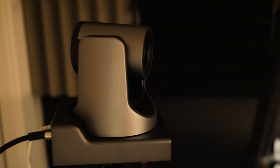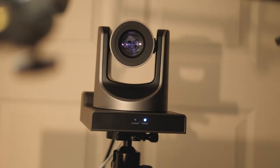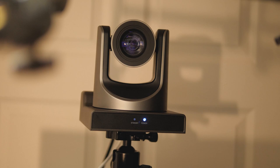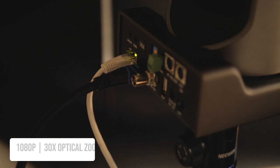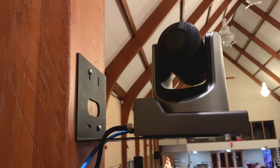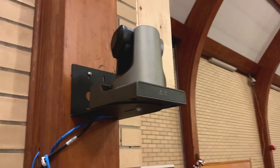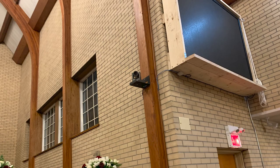The second thing we have is multiple PTZ cameras — to start, we began with two. The PTZ cameras we're using are AVCANZ, and they both have 30 times optical zoom and NDI. We're not going to be using the NDI feature because we have a switcher, so we're connecting directly with an HDMI cable. For longer distances, we run SDI from the camera and then use an HDMI converter to input into the Blackmagic ATEM Mini Xtreme ISO.